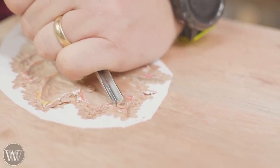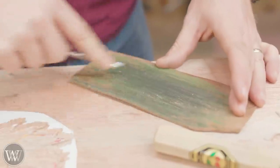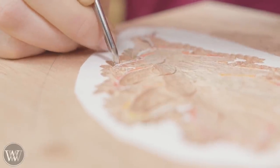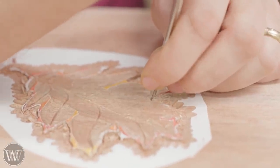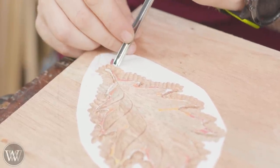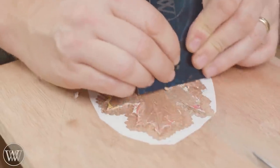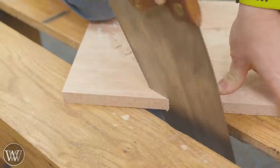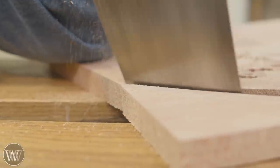Once we get it down to really close to where I want it and it's about the right shape, I'm going to come back with the v-tool and outline where the veins in the leaf would be — that just sets it up a little bit. You'll notice I'm using the strop quite a bit; about every five minutes I come back and strop my tool. I want it to stay sharp and never have to go back to the sharpening plate. Now that we have the inside mostly done, we're going to do a little bit more on the outside, taking it a little deeper. We'll make the stop cut again, then pare into it all the way around, make it a little deeper and clean it all out. Last thing is to scrape off the paper — I'm going to plane this down and clean it out anyway, so scraping it off is not an issue at all.